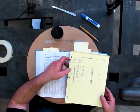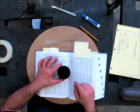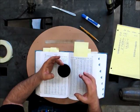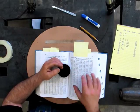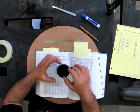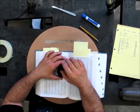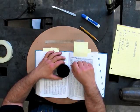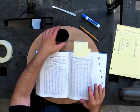And so what that will generate is a circular pattern with 20 equally spaced holes. And we're using rectangular coordinates to locate it. The advantage of that is it's just inherently more accurate than angular indexing. So it's a very accurate way to space holes around a bolt circle equally. In the old days, we used to use dividers, and we would adjust the dividers a little bit and move around. It takes a little trial and error, and you can get pretty close with that. But with this method, you can get extremely close, as close as you really want or would ever need to get. So this is going to be a real accurate way to do this particular thing.